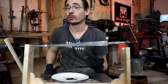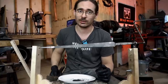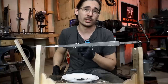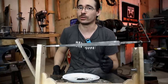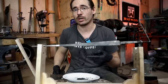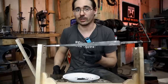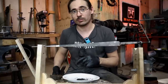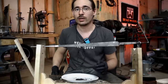In order to prep the handle for the wire, it's necessary first to make a mixture of epoxy and anything black, like scale or, in our case, charcoal. The reason being, the wood is white, basically, and it will show too much through the in-between of the wire. Once you cover it in black and then put the wire on top, not only will the mixture of epoxy and charcoal hold a little bit tighter together while you're completing your procedure, but also in the final product, you don't see the unsightly white shining through.